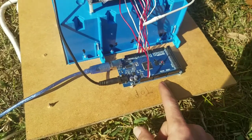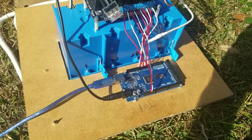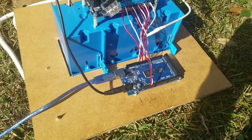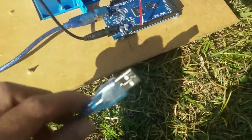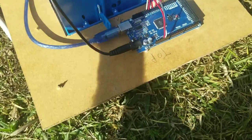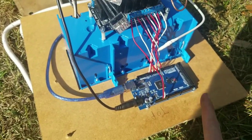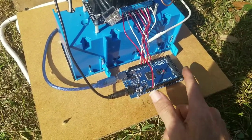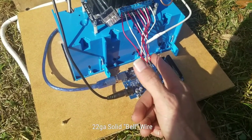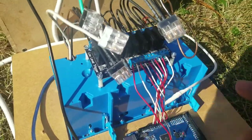All the grounds are connected in this one. Now this right here is an Arduino Mega 2560 — it's actually a clone, not the real Arduino. You can get these off Amazon for less than ten dollars. You can program them via the Arduino program, or there's Vixen, a Christmas light program — there's a couple ways. You program it via a laptop with a USB cord. Once you program it, via these wires right here it sends a high signal which is a voltage signal, or a low signal which is no voltage and shuts it off.